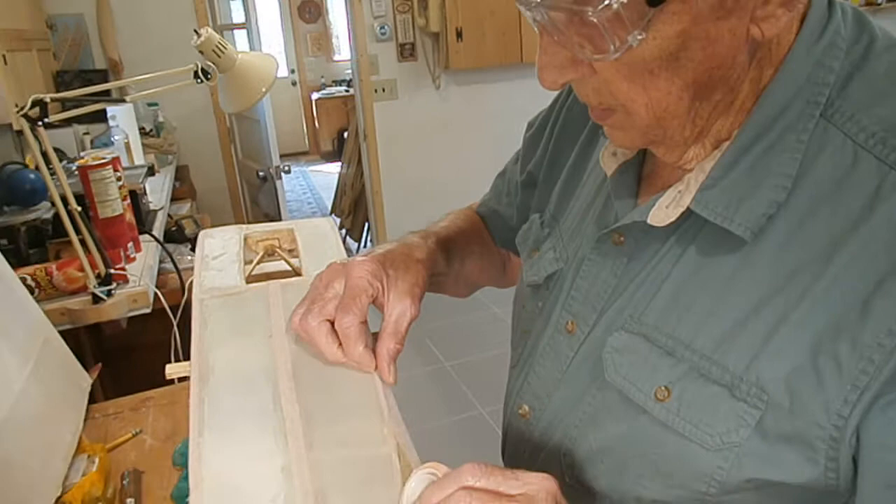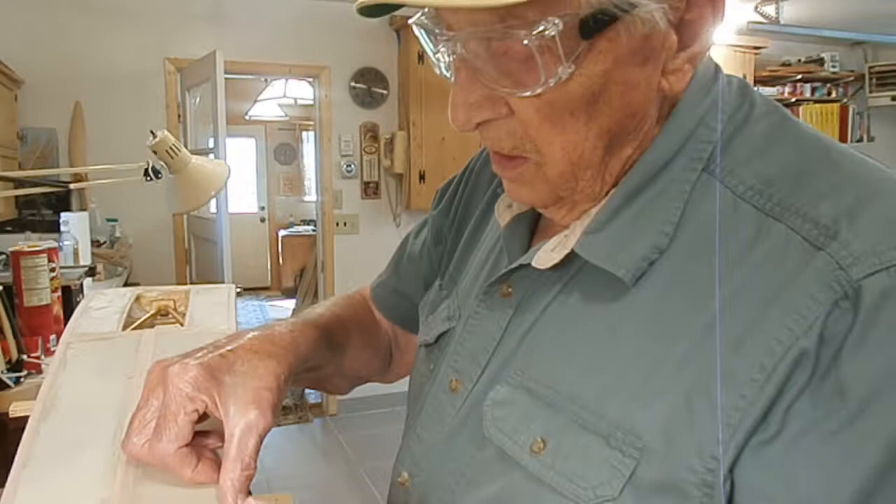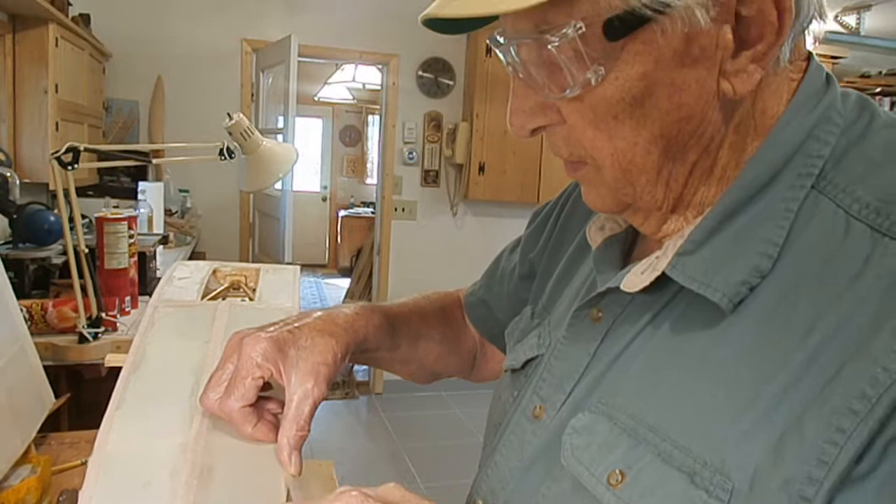That's what I'm doing now — before you put the first coat of dope on. Clear dope, nitrate, thinned out — you put the tape on first. Right in the center of your seam is where you do it.